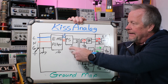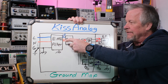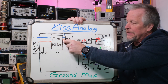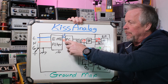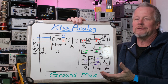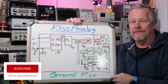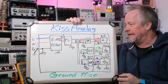Then we have our power supply. The line and neutral come through the EMI filter and are passed on to the power supply — not the ground; we're already done with that. The power is line-filtered and neutral-filtered at this point. We could show a primary ground symbol there. The reason we like to use ground symbols is because they're global signals — we can place them around the circuit without having to run a line to everything. This is primary ground, and then we go through a transformer for galvanic isolation on the secondary side.